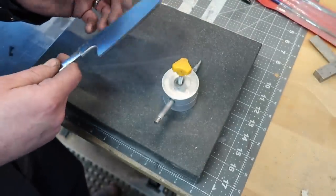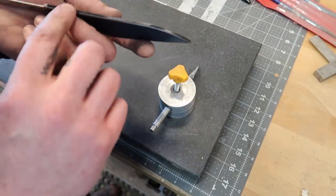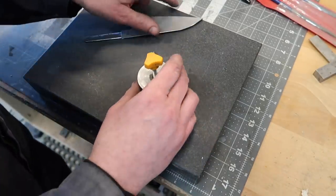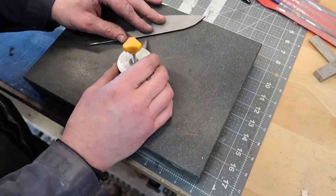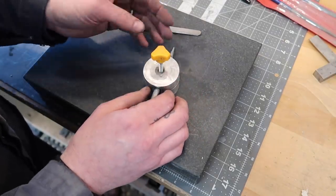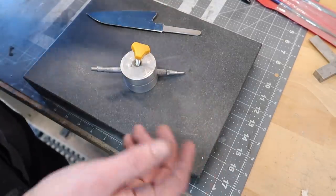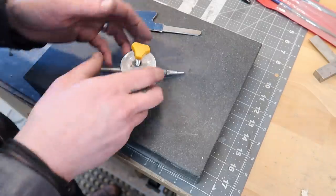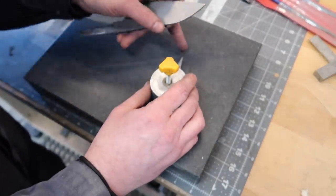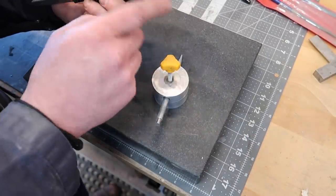Pre-heat treat I'm not going to go quite that thin. A lot of people wonder how I set this up - I always put a little bit of marker on the back and just kind of test it. I'll do a little mark here, very light marks, see where they're at. If I need to move this up and down by moving it in and out, I can do that. It's pretty much trial and error - I'm really quick at it now when I set up for different blade thicknesses, but I don't measure it or anything like that, I just kind of do a little test scratch and set it up. Doesn't take very long and it works good for all different blade thicknesses.